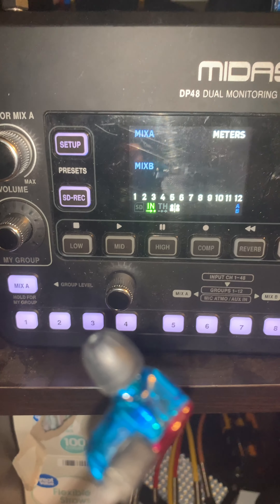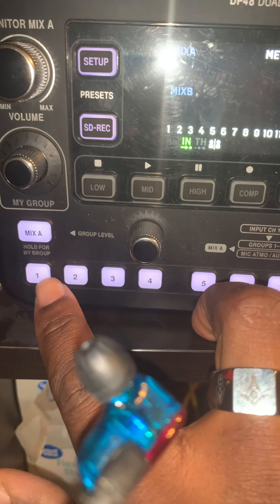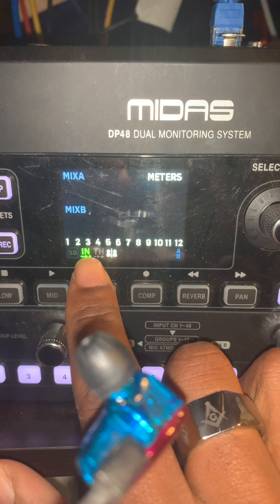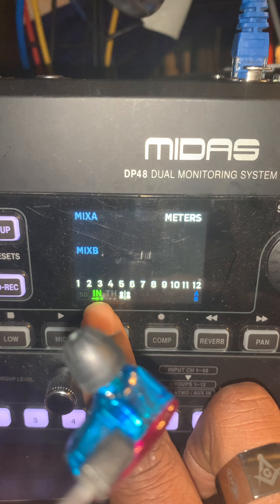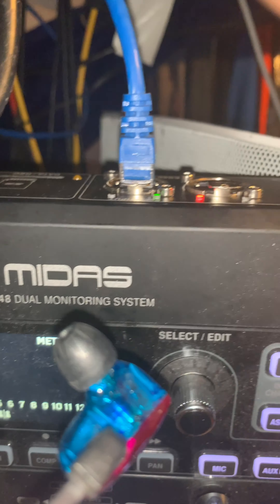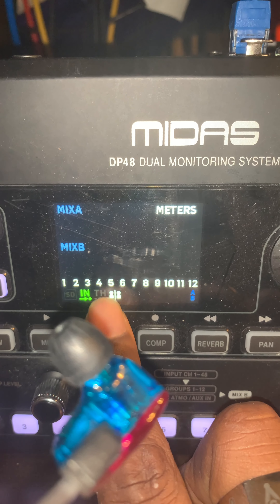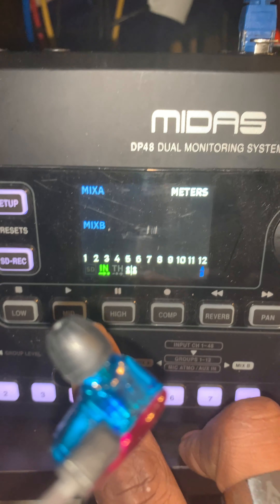Let's say channel one — they reflect from one to twelve, same on both sides. Make certain your signal is going through good. This Cat5 cable going through good — you'll see a green indicator because they're going to be daisy-chained together. Daisy chaining means I plug in one and it connects to and powers the next one. It'll be red if it's not working, black if nothing is plugged in, and green if it's working. Make sure that's going right.